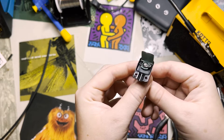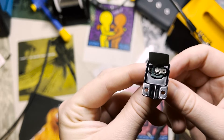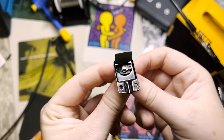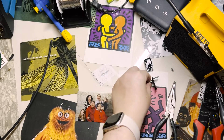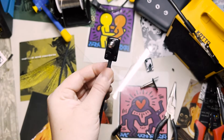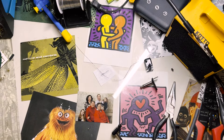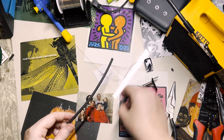I've already unassembled one of the square plugs. On the inside you have two tabs — the tip is the larger tab on the right, and the sleeve is the smaller one on the left. I've already done one side of this cable. If you do everything right during your soldering, you'll have excellent strain relief and a very solid, long-lasting, quiet cable for your pedal board.